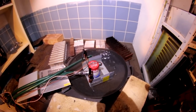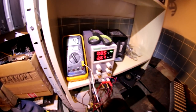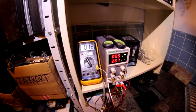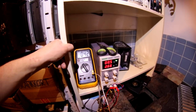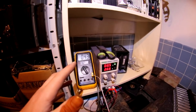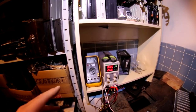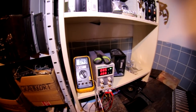This is working so well I'm just not gonna put the older pot back. We are maintaining 42-43°C circulation temp on the same fan settings, flow settings, and the same fire as before. We were sitting at about 36-37°C before, so that's about six degrees warmer.